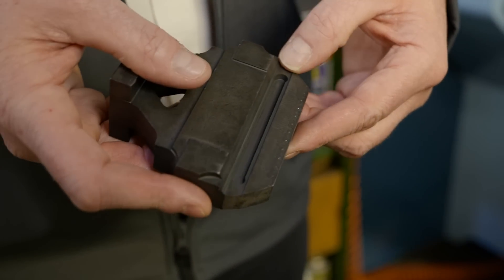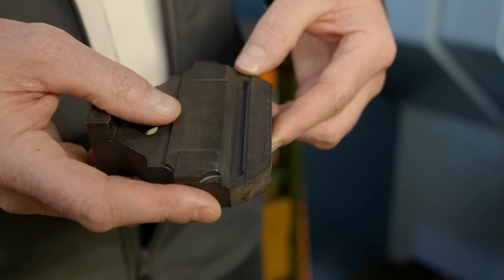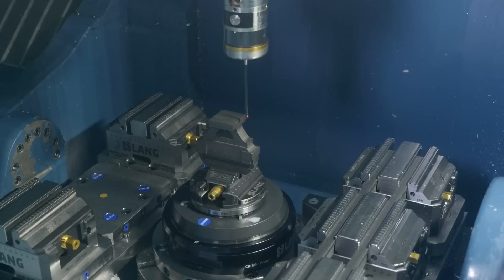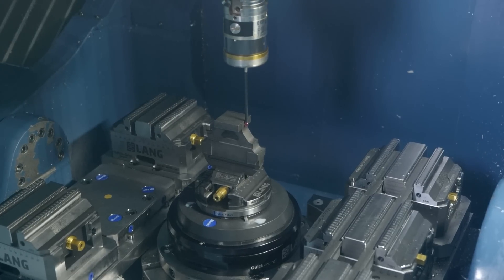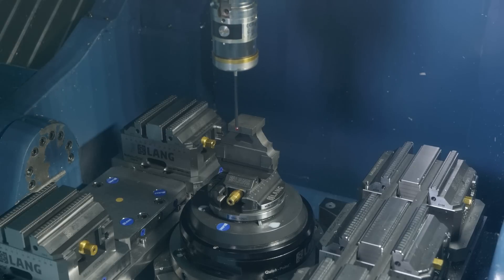That must also make it nice for the Haubeck, because it's always gripping in the same place. It uses the same grip every single time. All we have to do is make sure we load it based on the index mark in the middle and it will always be in the same place. We do probe — it's a five-axis machine — to make sure it's within a few microns of where we need it to be. But that's all we do, and then we machine.